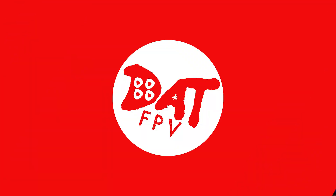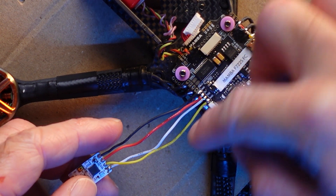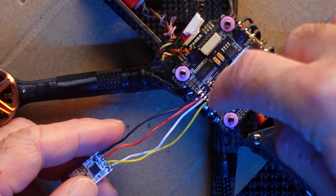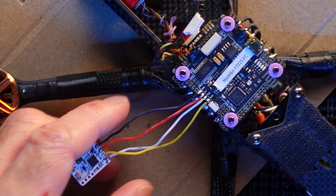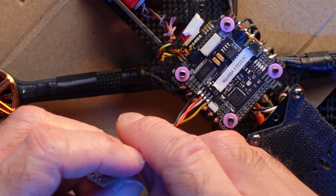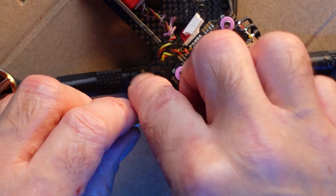I'm going to get these in really quickly. There we go, they're all in. You've got your ground, your power, and then — that is RX which goes to the TX pad, and then you've got your RX pad there, and that is TX, so the yellow is TX. All in place. All I'm going to do is twist these cables around, get the antenna in place, and see if we can get them in somewhere.